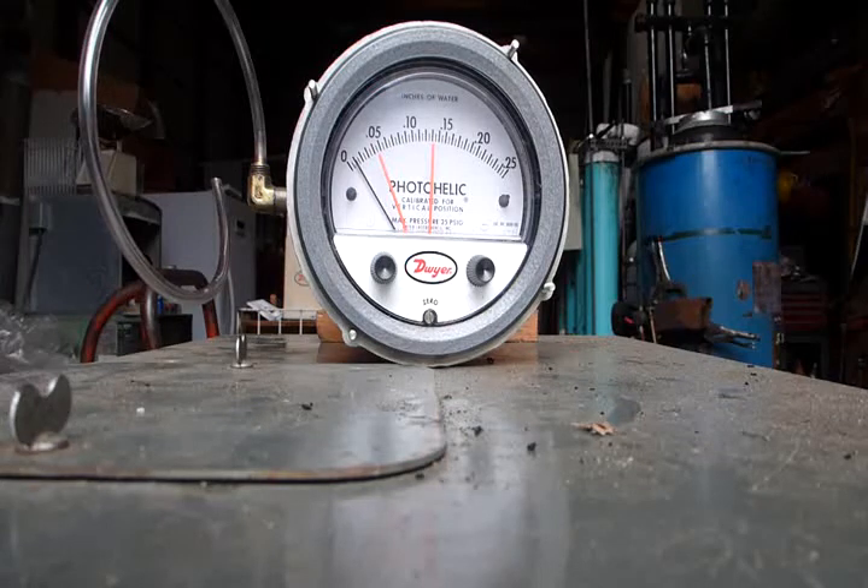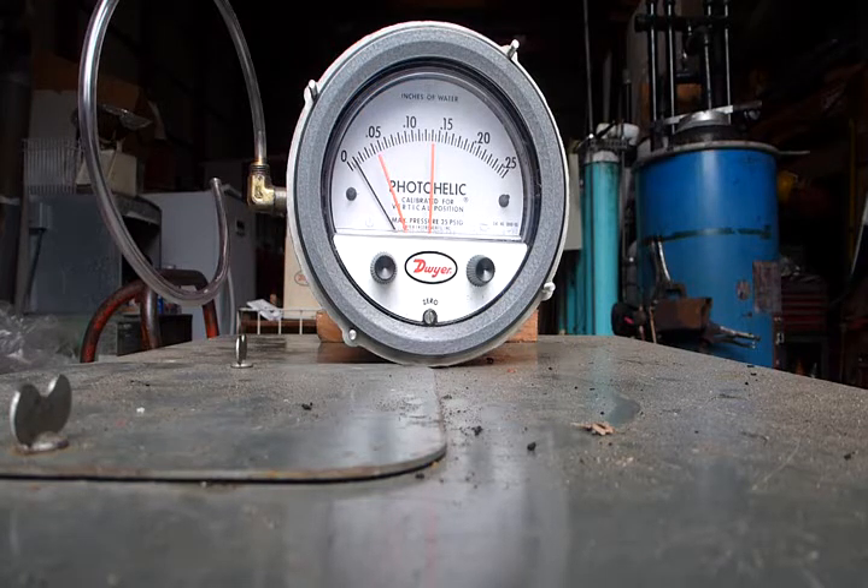After watching a video from the Drizzler gasifier page and speaking with Luke about the condition of the ember bed being so important with gasification — and their extremely long runs that they've been getting — I'm starting to head in that direction, toward keeping an ember bed that is very, very stable. I think our grate shaker is a little overpowered, and all our filtration and everything downstream is actually secondary and just a cover-up for all the mistreatment of the ember bed.